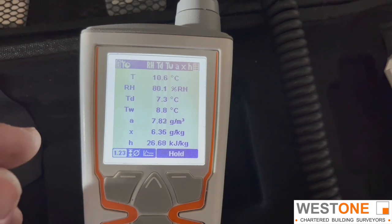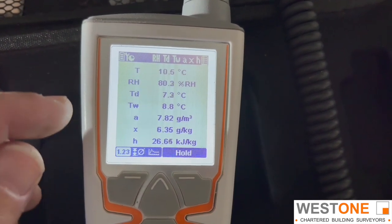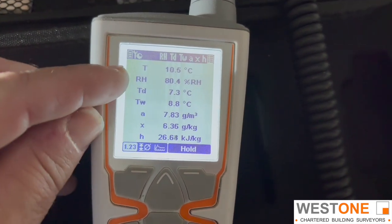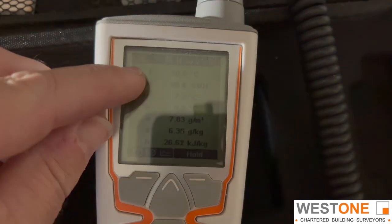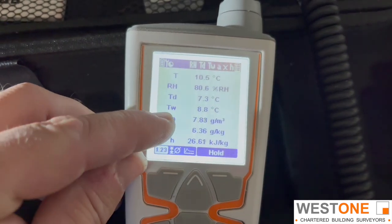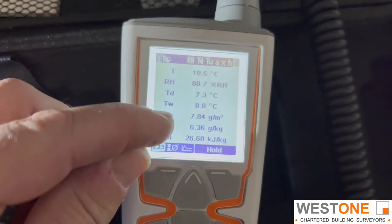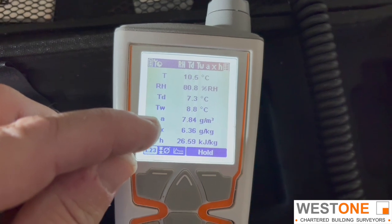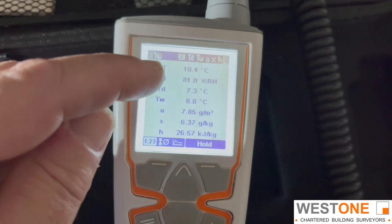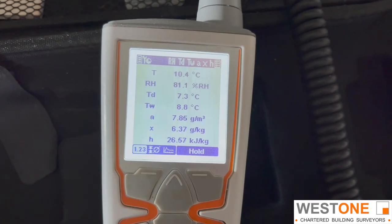There are way too many things on Facebook and YouTube that solely rely on relative humidity. The R is the misleading bit - the H is the humidity. And this is A for absolute humidity. The absolute humidity is the more accurate one. This is actually how much moisture vapour is in a cubic metre of air, regardless of the temperature. If the temperature goes up, relative humidity will go down. If the temperature goes down, relative humidity will go up.